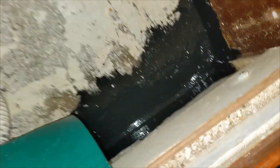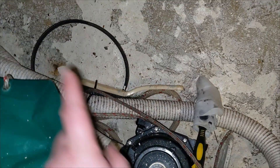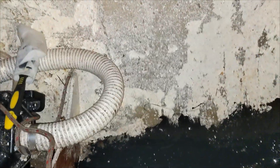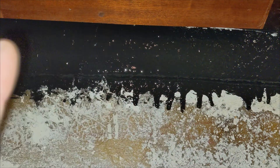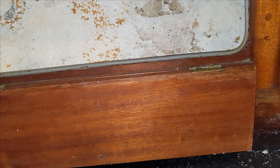So I went digging, and I found that the inside of here — you can see I've tanked it temporarily just to stop the wood getting ruined. Here is my bilge pump. When the pipe goes out, it's going uphill, so any water left in can come down and seep out — no problem. But it was seawater on the inside. And then this stringer along here was also wet, and inside this cupboard was wet. I tasted that water in there and that was fresh. If you look along the bottom edge of this cupboard, you can see stains from water damage, so this has been happening for quite a while — but I think that might be off condensation, because all along this stringer was wet and that was all salt water.